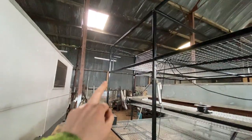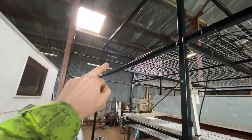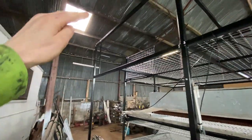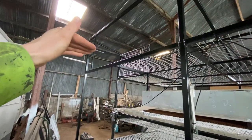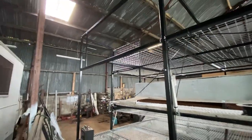Okay, I'm just running all my wires here. My control box, my battery is going to sit up there in my control box, and my electric fence charger is going to sit right underneath it. The reason I have everything together is to keep the cables short, because the solar panel is going to be on the roof on top and the battery is going to be right here. So there are really short distances between everything, so we won't be losing any efficiency in the cables.